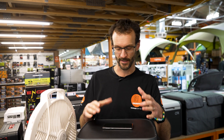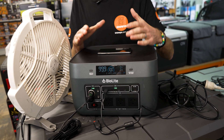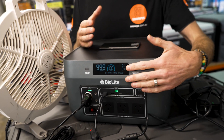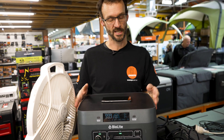To give you an idea of what this will run: you can power a 12-volt fridge from the DC ports for about 40 hours. You can get about 20 charges out of a laptop. You can probably run a full-size fridge off this for about a day, depending on its power consumption. You can run a corded power tool for about 60 minutes. A better use with power tools though is to charge their batteries — as a guide, if you're trying to charge a battery smaller than the one inside this unit, you should be able to charge it from the Base Charge 1500.